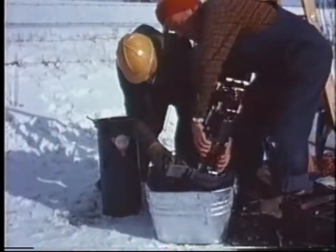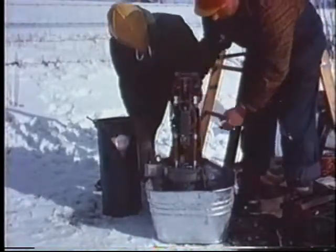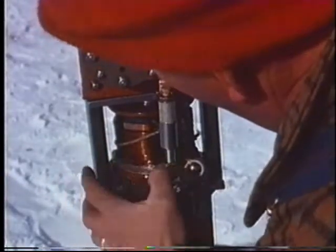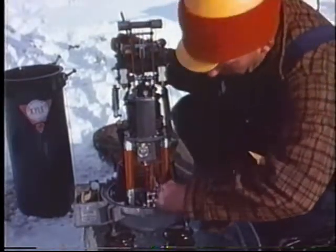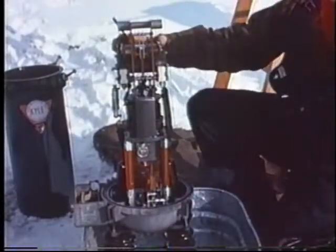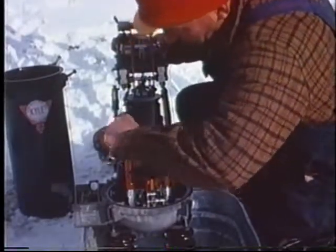The mechanism is then placed upside down in a suitable receptacle for detailed inspection. Examination of the mechanism includes the following points: check all parts for damage, check that the springs are in place, examine the insulation for any signs of breakdown, and make sure that all connections are tight.